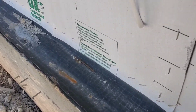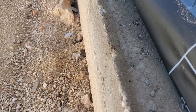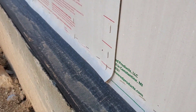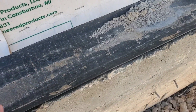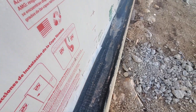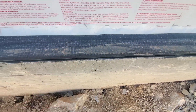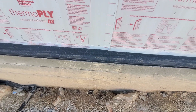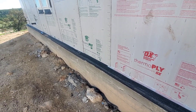One thing I'm seeing on all sides here is that the masonry ledge has this lip on it. This lip is going to prevent water from flowing out of the weep holes — it's going to hold water. You can see how it's already cupping the masonry flashing here. It's just going to hold water into this little cup, which is going to hold it against your sheathing here, and that's a big no-no. This has to be flat. If it's not promoting drainage, it's promoting retention.